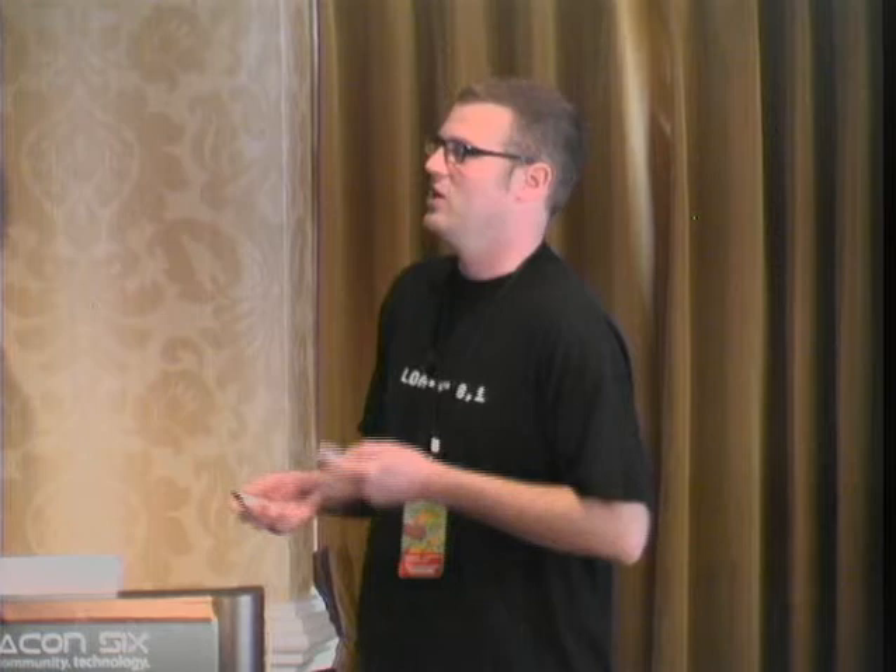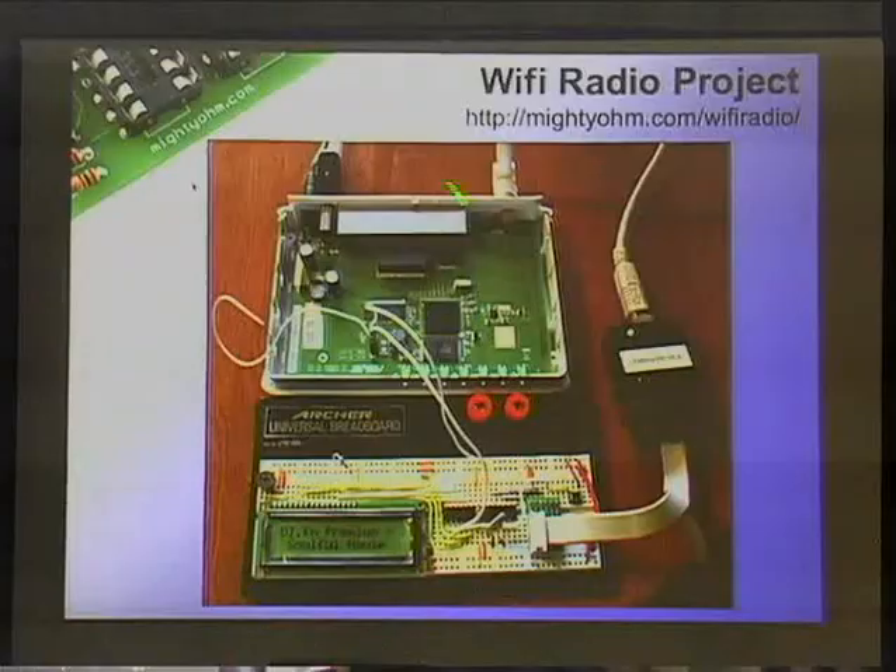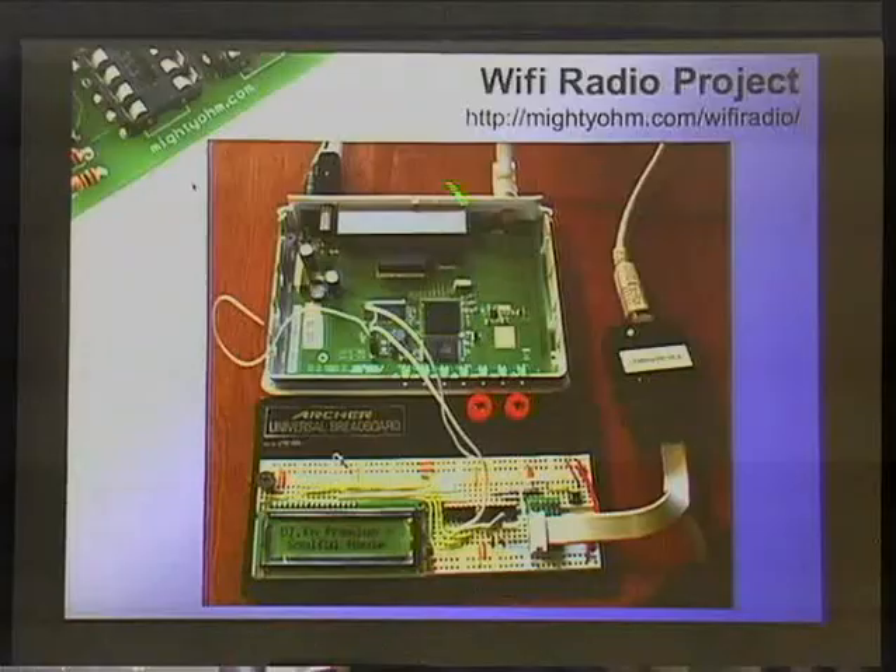This is my project. I had a vision to build an internet radio. I know you can buy these, but at the time they were still at least $200–$300, and I wanted to listen to Shoutcast streams without a weird interface. I decided to build my own. That's when I started looking at wireless routers — because if you have a wireless router with a decent CPU, you don't need a lot. We were playing MP3s back when we had Pentium 75s. So I take this router, put on a USB to audio converter for $7, plug it into the router, and I added some extra parts.